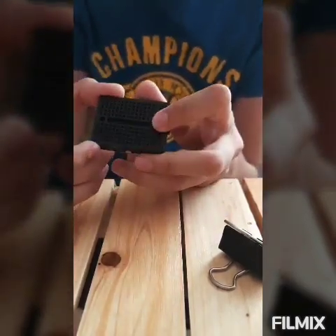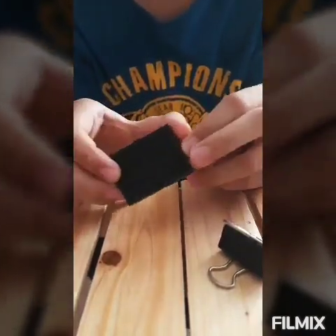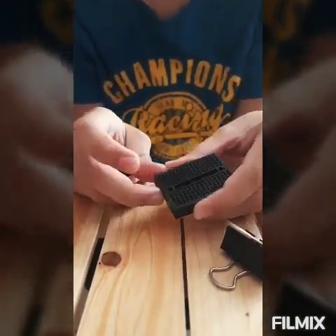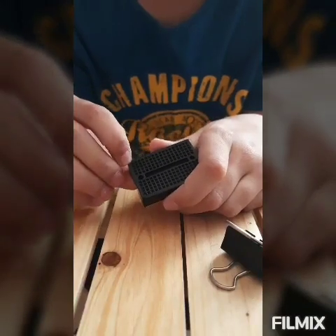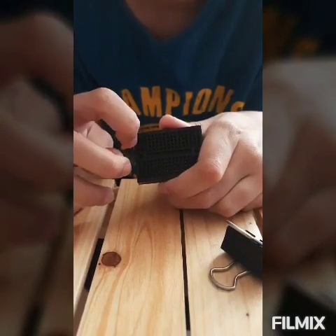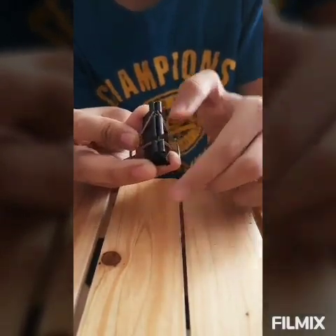We sometimes only get few pins on the main board. If you have seen the Arduino board, there is only one five-volt pin. So if you want to connect more than one sensor, what will you do? For that, we can use the breadboard and just plug it here. So now this whole row will get the supply. If I just plug any one pin here, this whole row is charged with the positive current.